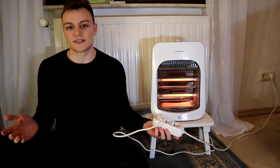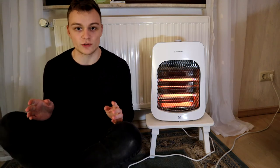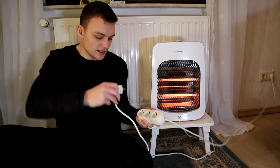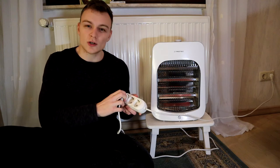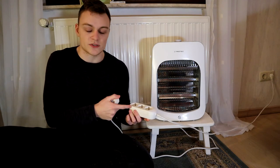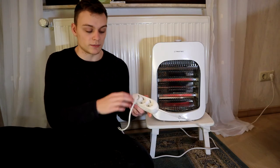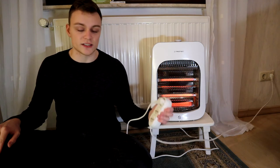So why does everyone say you should never plug a space heater into an extension cord? The answer is pretty simple. Because most space heaters run on 1500 watts, the electric grid of our house can't really handle much more. As soon as you plug in more devices into your wall outlets, the electric grid gets overpowered pretty quickly. Another issue is that right at the connection point between the extension cord and your space heater power cord, there is not always a perfect connection — there can be dust or other disturbances that increase the electric resistance between the two cords.